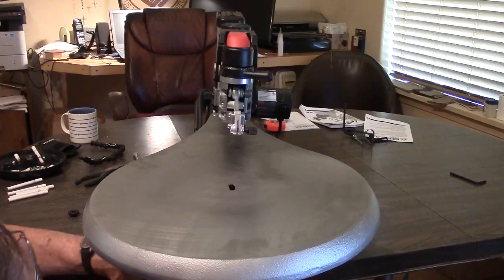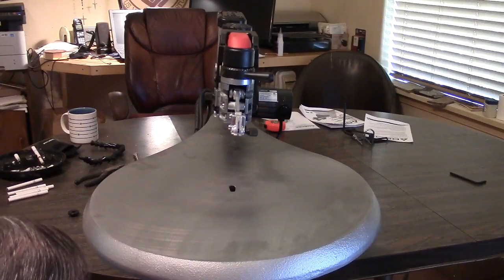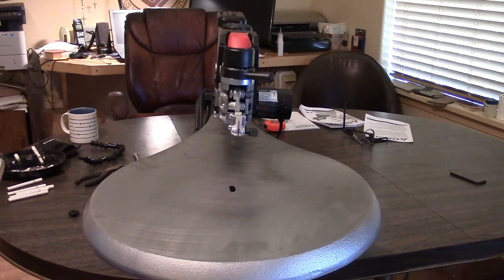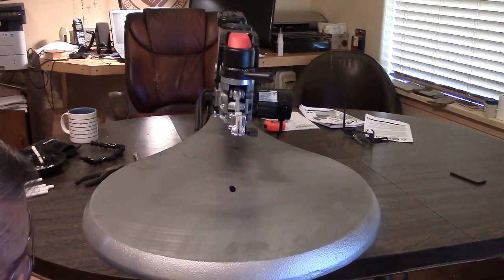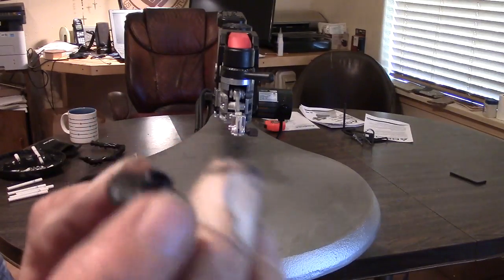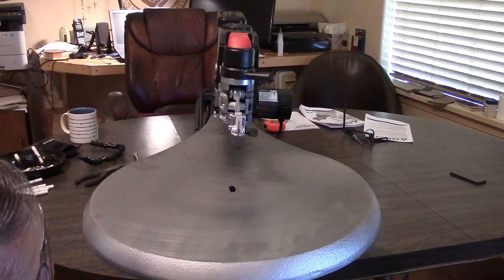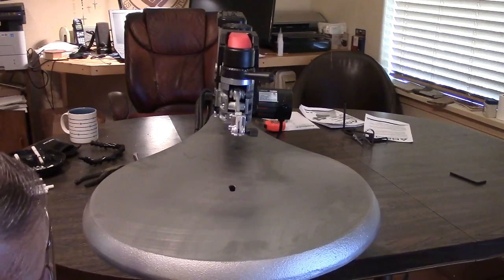Now, slide the saw out to where you can reach underneath. Don't slide it too far. Where you can reach underneath and slip this bolt through its hole. It's a little tricky, but it just takes a second. And there are shoulders back there to keep the nut from turning. Put the washer on. Hold your finger underneath there for just a minute. Put the washer on the correct way. Remember we showed you where this little tab that's sticking on that washer has to go in the groove. Over the bolt, in the groove. Handle goes on. And that tightens the trunnion.